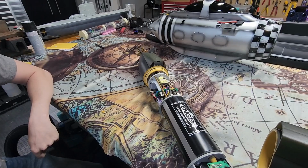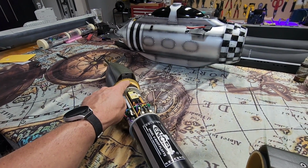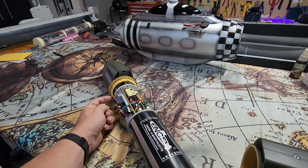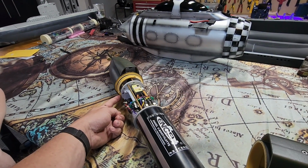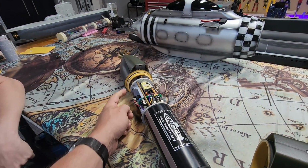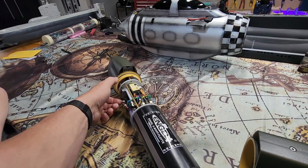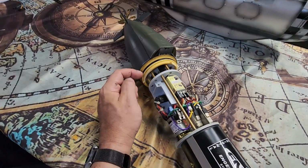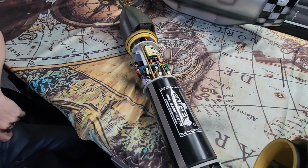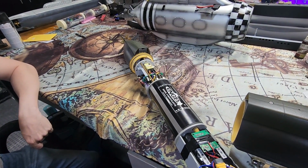Which I like, but the issue that is not good is that this is spaced about 1 inch high. So if this, for whatever reason, flexes at all, it could push the bottom out while the top is locked in. If this was more of a sleeve that went further in, it would maintain alignment. But this is pretty narrow. This is about 3/4 of an inch. So it can definitely twist. And that's a lot of force. There's a lot of pressure in that WTC when it's fully cycled.